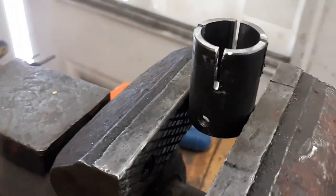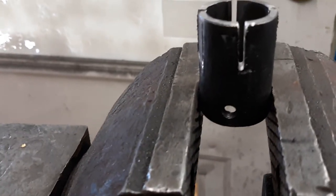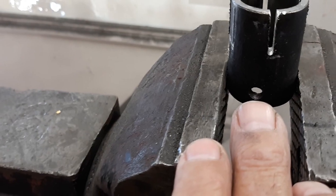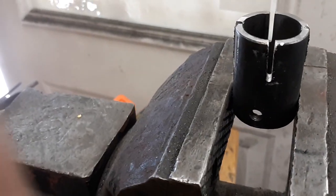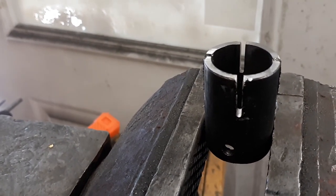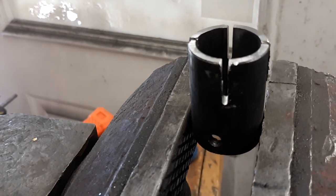And on this side you can see there's a quarter-twenty bolt hole for a set screw right here, that will hold that on the end of the three-quarter pipe. So what we'll do is we'll flare this out a little bit on the end with a drift and weld it, and that'll be it. You'll have a flare for the end of your forge burner.